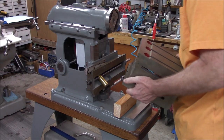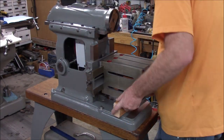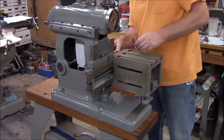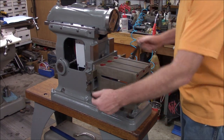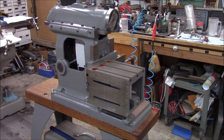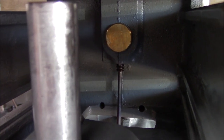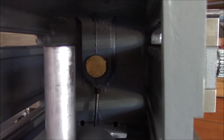I think I've got everything staged here. I still have the other one to put on underneath and there's a gib that goes underneath too — I'm going to do those bottom ones off camera, the battery's just about dead. I'm putting in this set screw while I'm thinking about it so I don't forget for our cross rail nut that's back behind there. There is access through the bottom to get an allen wrench in.